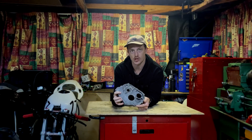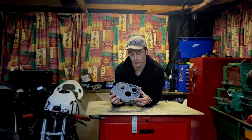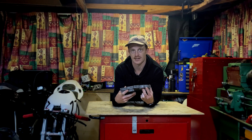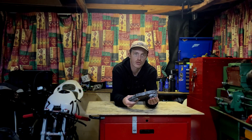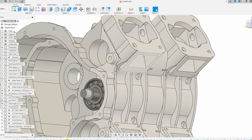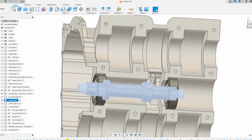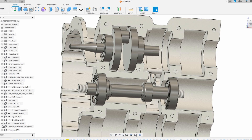This could actually be used to practice machining, but I'm not going to do that because I already have another pattern ready to go. We're going to get this cast for real — this and the front crankcase half — and then those are going to be sent away and heat treated to T6 hardness. Once that pour is successful, I'll be machining the patterns for the rear crankcase half, then line boring the cases and making up a 4140 steel shaft. That will be hardened and we'll cut the gears — a gear on each crank coupler and two gears on the layshaft — to transmit power to the stock Triumph gearbox.